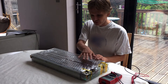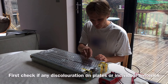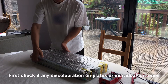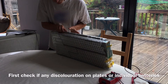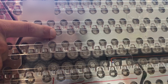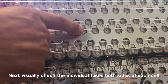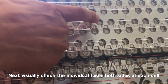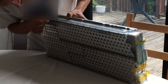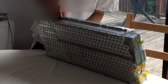The first check is just to look at these plates and check for any discoloration on them or on the batteries that you can see through the plates. This side's good, and you can also look at the other side — that's also good. You should also check each of these individual fuses wired into these batteries. Each of the 444 batteries has an individual fuse, and you just check visually that none of those fuses have blown. It's all good on this side and also on this side.